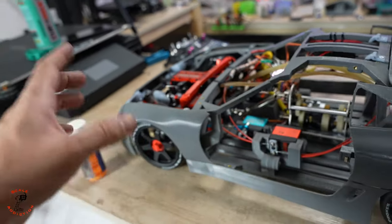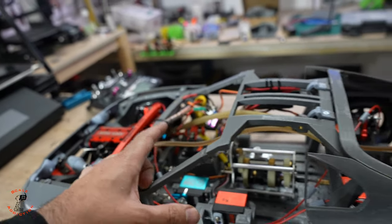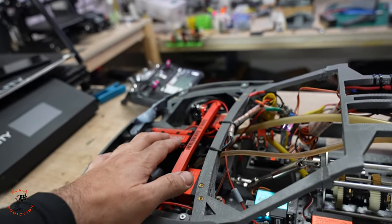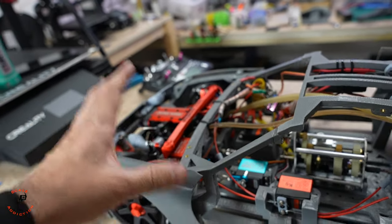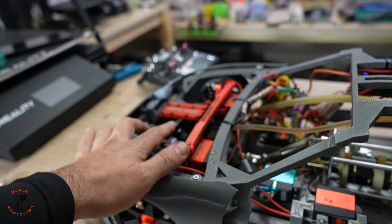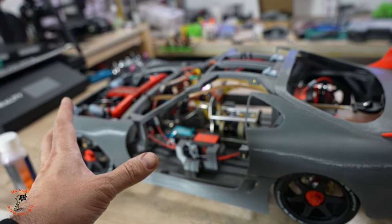But overall, it starts up and I don't have any problem, even with the cable, and the battery can supply the voltage to the glow plugs and the starter motor, so we solved that. But the only thing I have to adjust is the carburetor, and then we have to take it out and change the gears and see how it's gonna go.